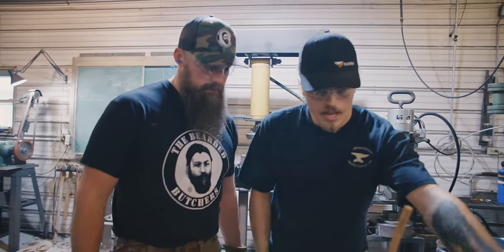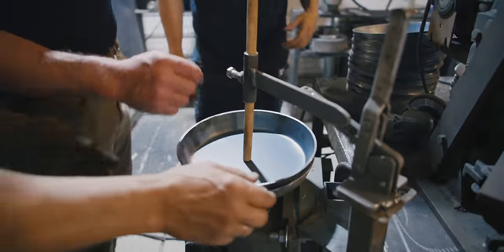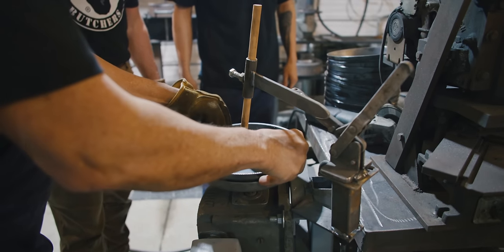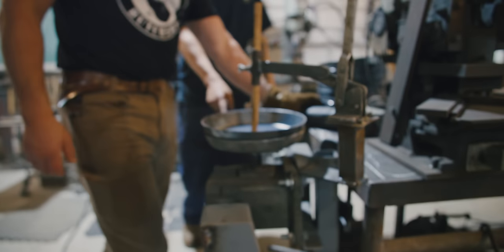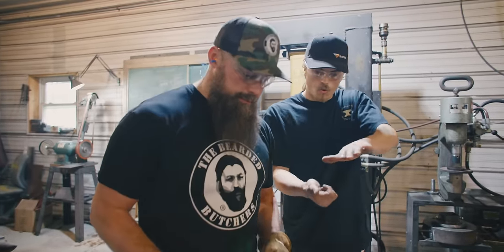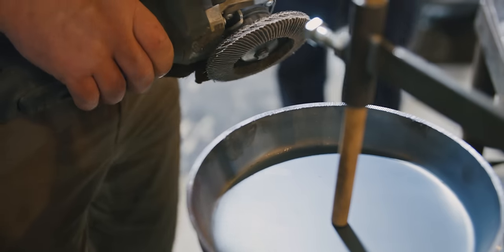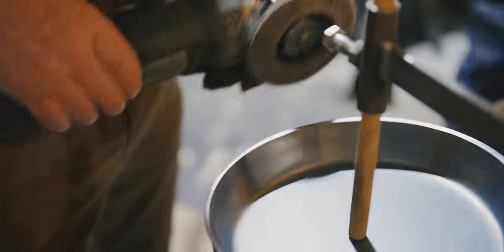Roughly centered, and then you set the tension with that. Make sure you get a click out of that. Hold on, it's already low. Let's make it a little better. Okay, try that. Boom, and then the pedal on the floor makes it spin, and just try and uniformly go from inside to outside. And you'll feel it, like once you stop again, you can feel the burr and notice where you need a little bit more.